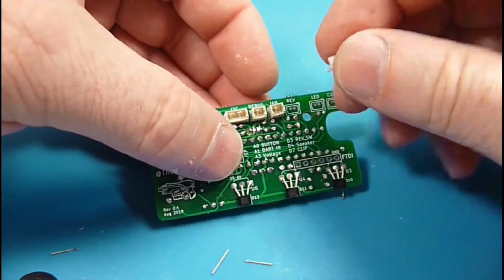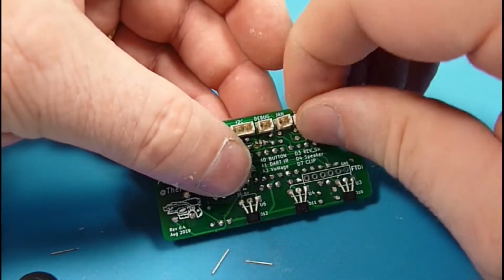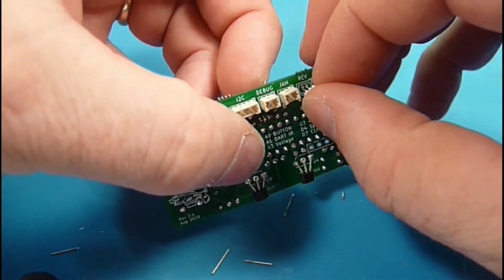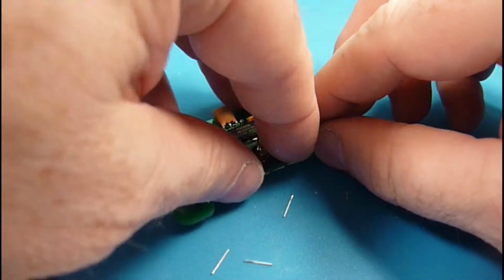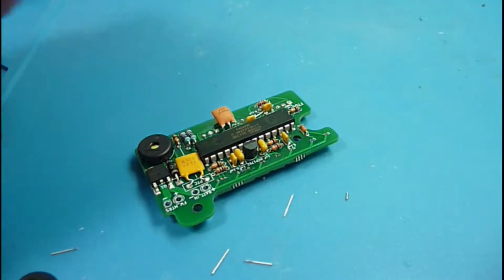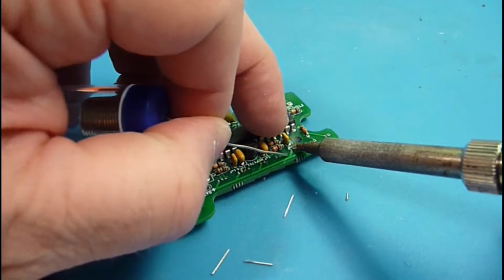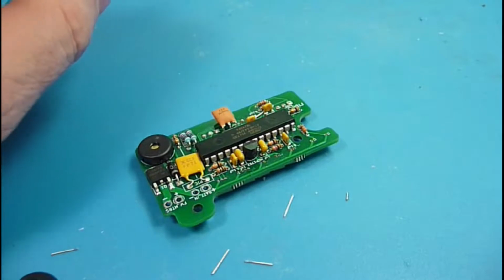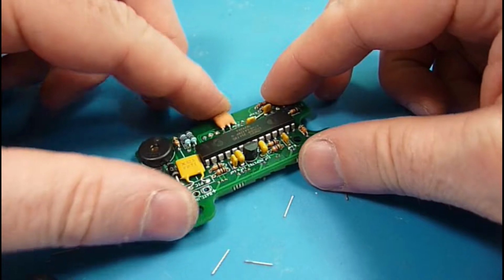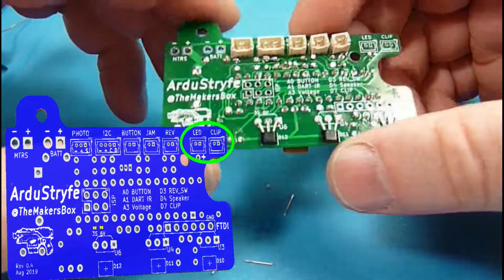And the reason I put connectors on here is it makes life a little bit easier for assembling and for troubleshooting. If you've got to solder your wires in there, there's a little bit of a reliability issue, as they wiggle around, they might break. I just decided to go with the connectors, and these are Pico blades from Molex. That's a whole other story on how I ended up selecting those. So in general, I've got 2 more of those headers to go, and I've got to dig them out of a bag, so I won't keep you around for that.